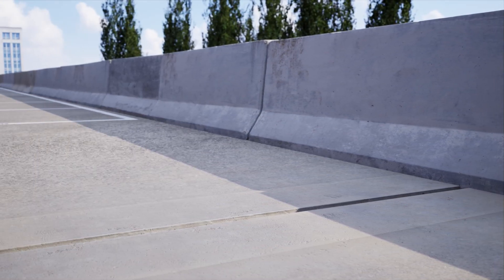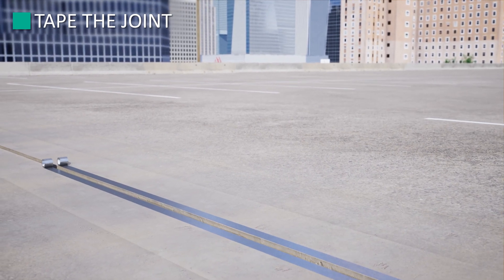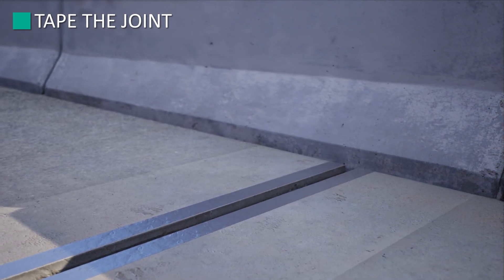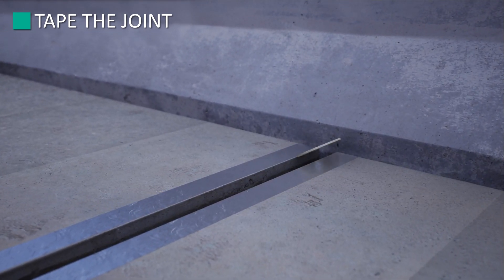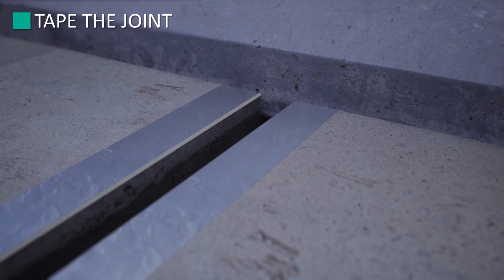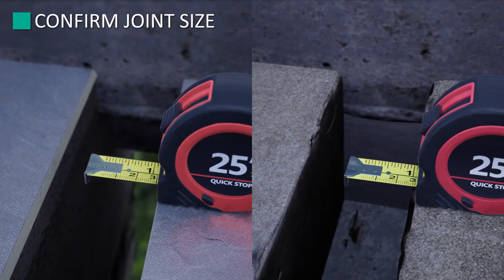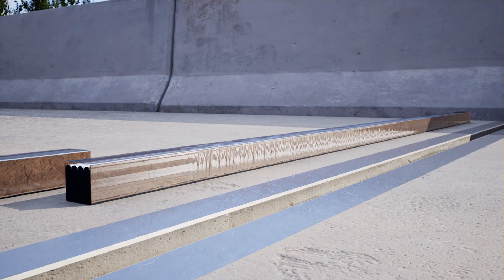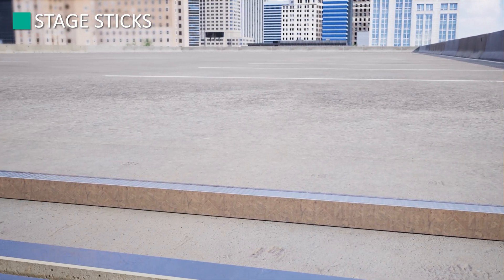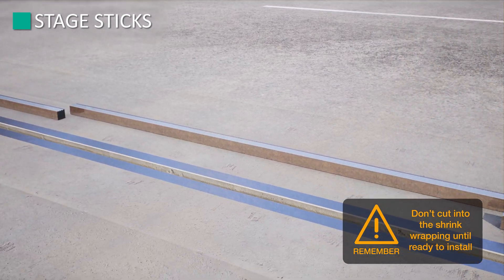Check for cracks leading into the joint and repair spalls. Consult a structural engineer for areas of concern. Using the 3-inch tape, apply it to the surface of the concrete deck, up along the joint and up to the joint edge. This will keep the area along the joint clean in case of drips during the installation of the epoxy. We also recommend using quarter-inch tape on the inside of the joint, butting up to the top edge to keep the area clean when installing the epoxy — this is important for the installation of the weather bead and necessary to achieve a strong bond to the concrete. Confirm joint gap size every 6 to 7 feet for the entire length of the joint prior to installation. Sticks must be ordered in quarter-inch increments of the mean joint size to fit properly. Stage each stick alongside the expansion joint, taking care that the proper sizes are in the right location. Do not cut into the shrink wrapping until you are ready to install.